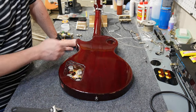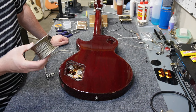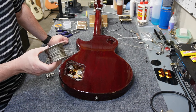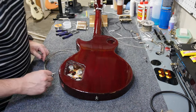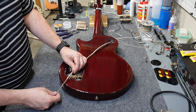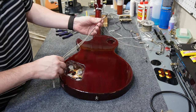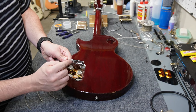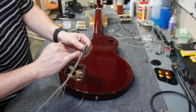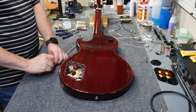Next step is to wire in the switch and the jack. I'm trying to use as much vintage-style stuff as possible, so I got a spool of StewMac braided shielded wire — braided steel on the outside, cloth in the middle, and a wire core. I'm wiring the switch and making sure to leave enough slack to reach the jack and the two volume pot positions. With this wire you push back the braid to expose the cloth, then push back the cloth to expose the wire end. I tied the shields together to ground with a small piece of wire, then taped them up before running them through.